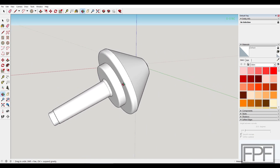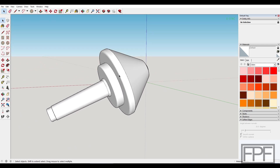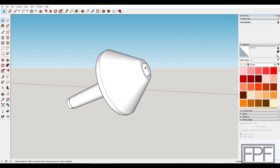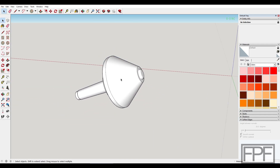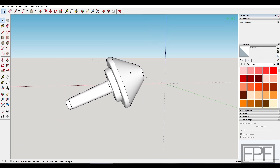I got this modeled up and I think it's pretty darn close. I measured all the diameters and I'm sure they're accurate. The things that are a little bit tough are some of these different steps with the radius corners and the spread between them — it was difficult to get some of the measurements. I could have taken the fastener out of the end and put it face down on the surface plate, but for the application of just creating a negative space for this guy to rest into, this is probably good enough.